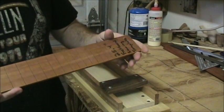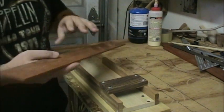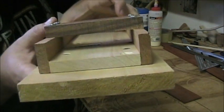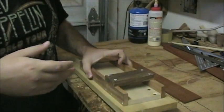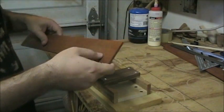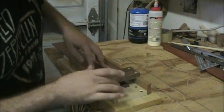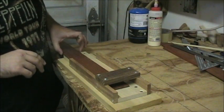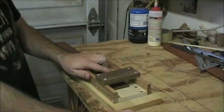Labeling makes it easy to know exactly which template you're grabbing. When I sandwiched the two pieces together with the saw in there, I inserted that tiny little blade as a locator. I wanted it nice and wide rather than using a locator pin or dowel, because the front slot is nice and wide. When you push the board through the bottom and it seats on that locator, there is absolutely no play - this doesn't move at all, which is the whole point.